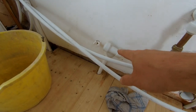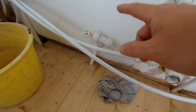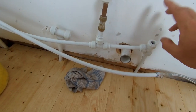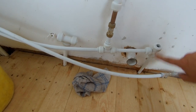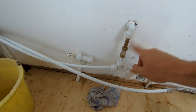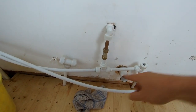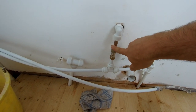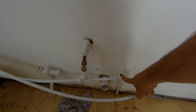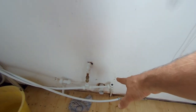I have put a 22mm pipe in before I did this floor, so we've got a 22mm pipe that goes all the way to the front of the house. At a later date I'm going to switch this mains incoming from this 15mm pipe over to the 22, and then I can run the 22 along here and branch off to the cold tap for the sink, cold tap for the outside, and then going upstairs to the bathroom — so hopefully that'll help with a little bit of flow, although the flow rate and pressure is pretty good here.